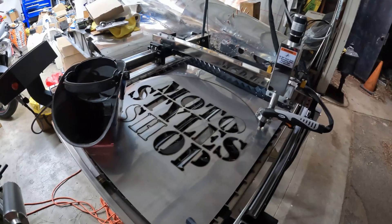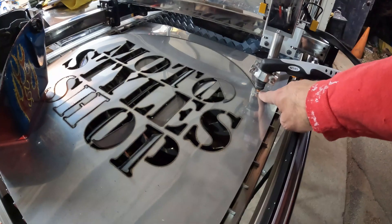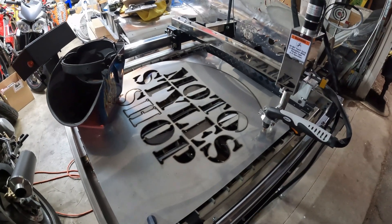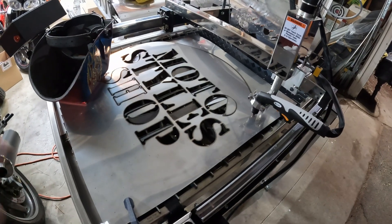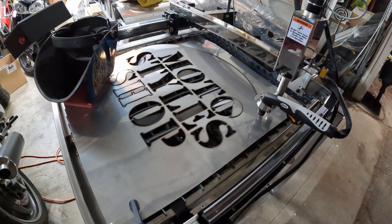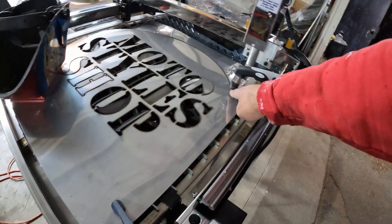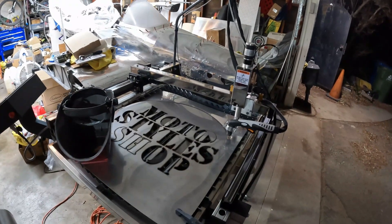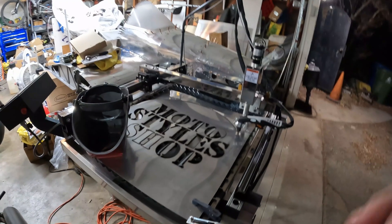So we continue with this contraption. What happened was the consumable got eaten after a very short time. The problem is that the metal is warping. It's Saturday and there's nowhere to buy parts, so here's what I did: you take out the consumable, take it apart, and there's a brass cone piece. You just take it and punch it with a nail to make a hole in it again — it was literally completely welded shut.